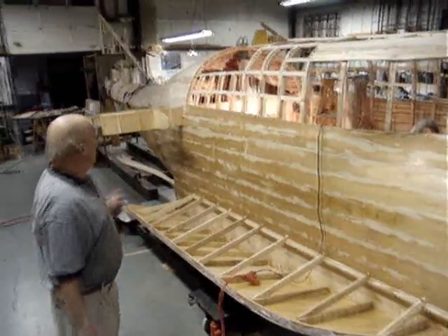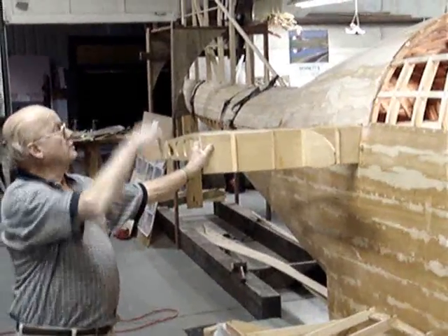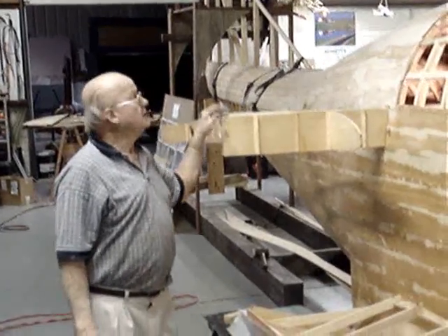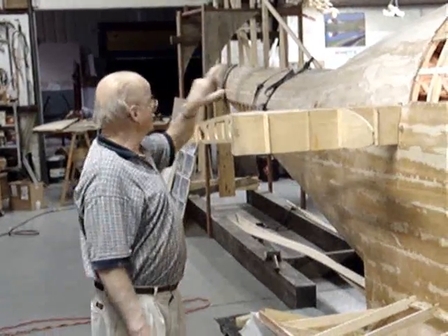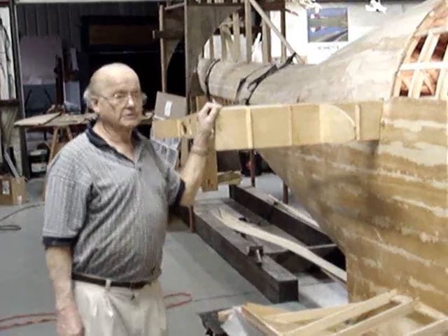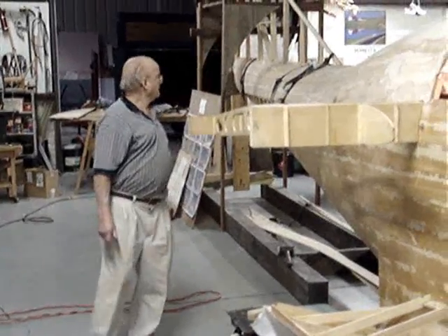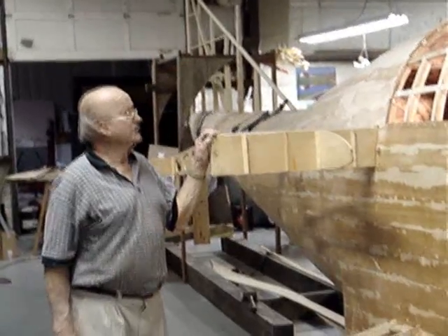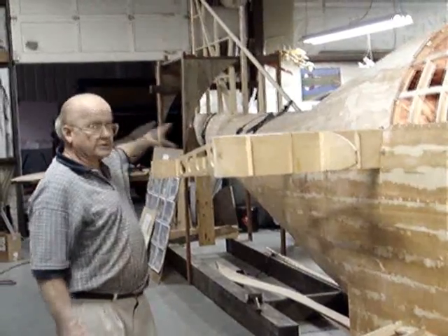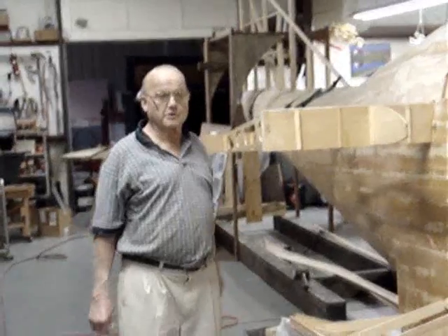These stub wings are the part in the hull that's the lower wing. The upper wing sits above this one — as I stand here the upper wing is 13 feet off the floor. The engines go between the upper and lower wings and the propellers are pushers, sitting back in this area here. We're working right now on getting all the internal bracing secured — bolted, glued, safety-wired, and cottered — and then we'll finish up the remaining planking on each side. The hull, other than putting in the controls, pilot seat, and so on, is pretty well complete.